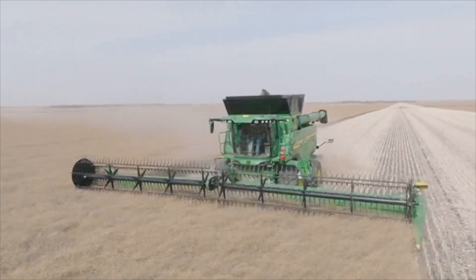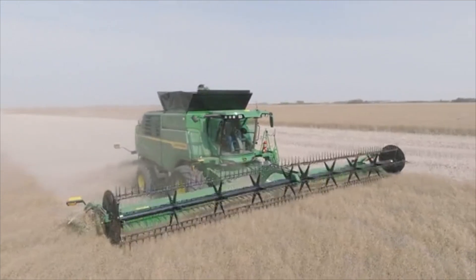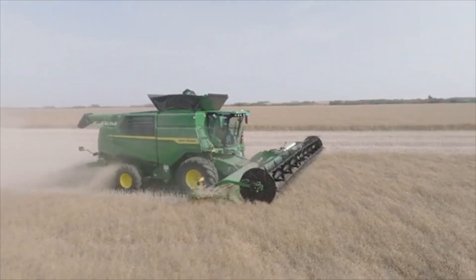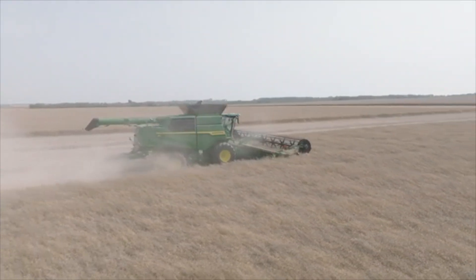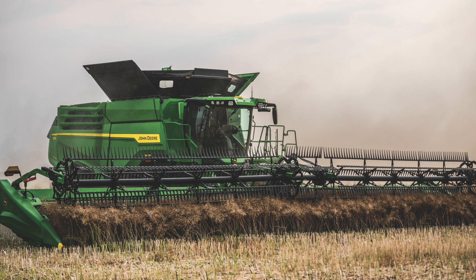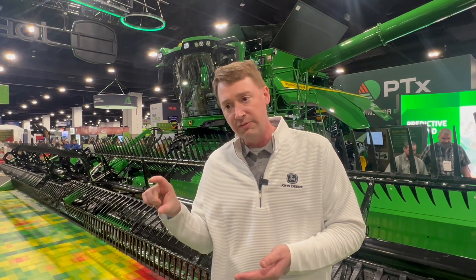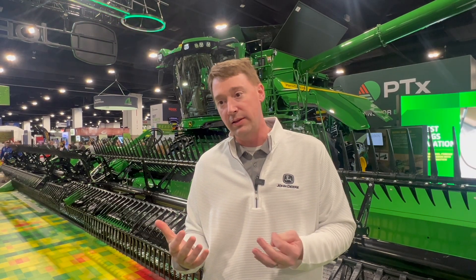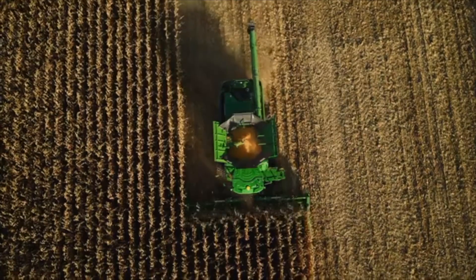From a draper standpoint, right behind me here, we have a lot to talk about. We're introducing our brand new three-piece reel on our HD series, available on both our rigid and flex knife configurations. With varying terrain and crops like pulse crops, edibles, and lentils — crops that have lower pods — this makes a lot of sense, with the reel-to-cutter-bar relationship staying very consistent across the entire cutting width. We also offer our two-reel, which we've had in the market for quite some time, giving customers a lot of opportunity to choose what best fits their operation.